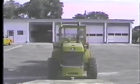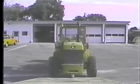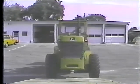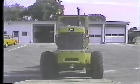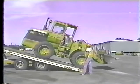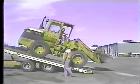Back the loader slowly up the trailer. If your loader has four-wheel drive, use it. And take it easy. This is where most accidents happen. Whenever possible, use a spotter to guide you, but make sure they remain in a safe position.